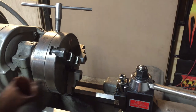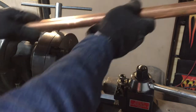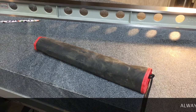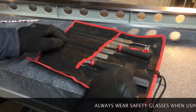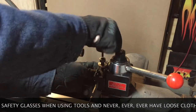The first step is to prepare the copper collar for the handle to prevent it from cracking or expanding too much. I'm gonna use the lathe to face and chamfer the edge of the pipe. I don't have lathe cutting tools yet, but I do have a file — it clamps in a tool holder and gets the job done.